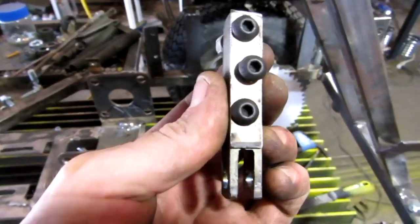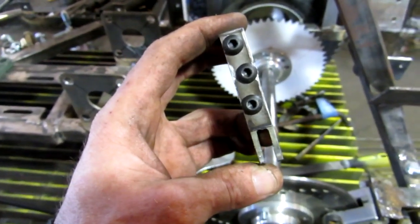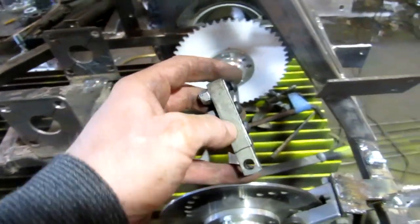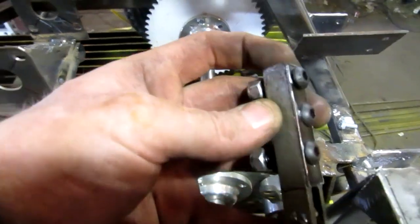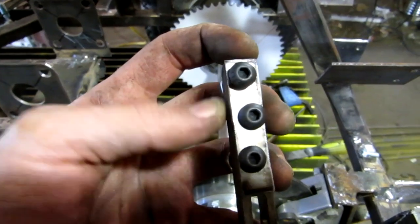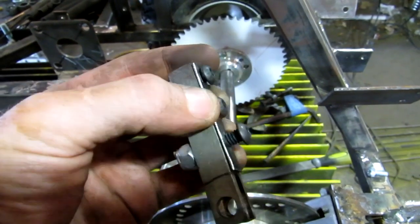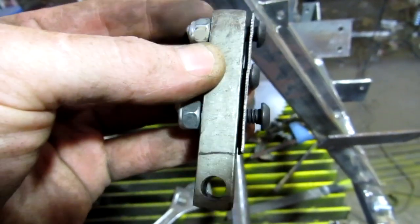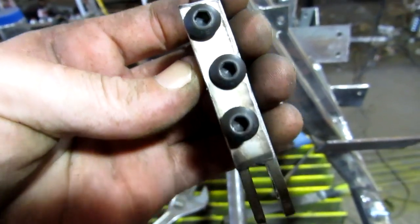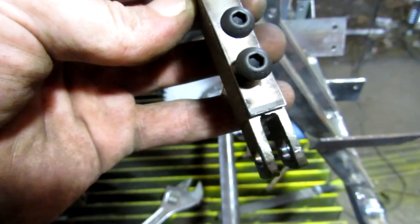I made it into something useful! I cut three inches here and drilled a hole equal to about the size of the pull rod. Then I drilled three offset holes because the cable is going to run in between those three points underneath the sheet metal - right there. So I'm going to try to weave the cable down inside there and then tighten all three of these bolts and nuts.